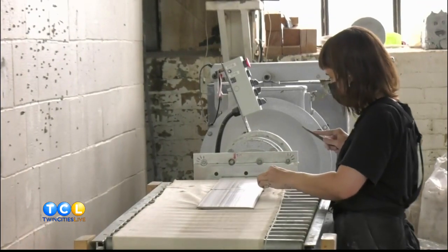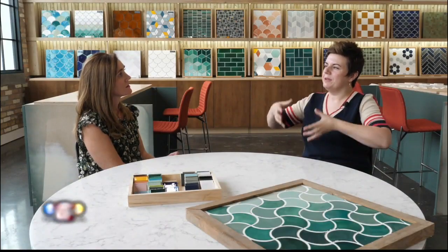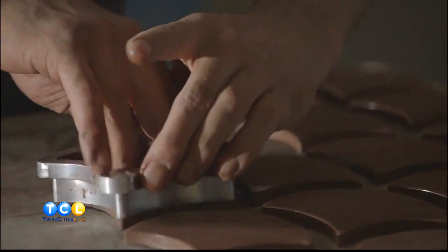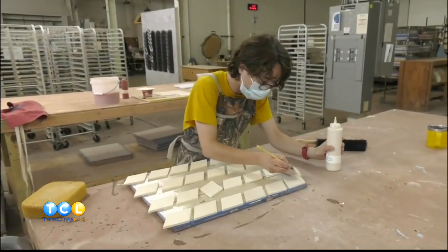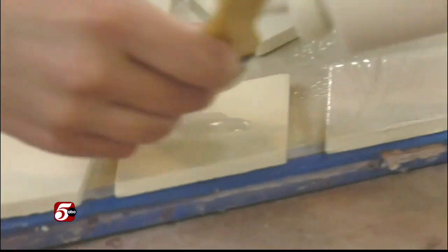You start with the clay, and now, to not exhaust artisans, we have a piece of equipment called a pug mill that you process it through. That's going to feed you these beautiful ribbons that mostly have all the air out of them, so you can cut out or slice the shape that you're making. Then we run them through our kilns and turn them into what's called bisque — that's naked ceramic without the glaze. Then they come into our glazing department and that's where we're hand-brushing on the colors. That's really truly where I think a big layer of the magic comes.